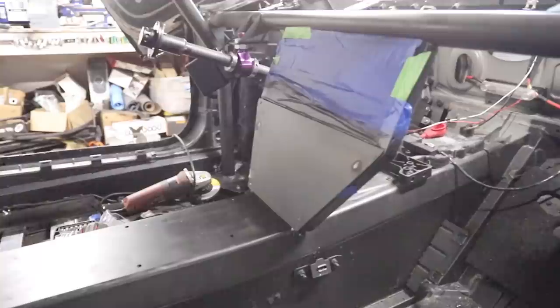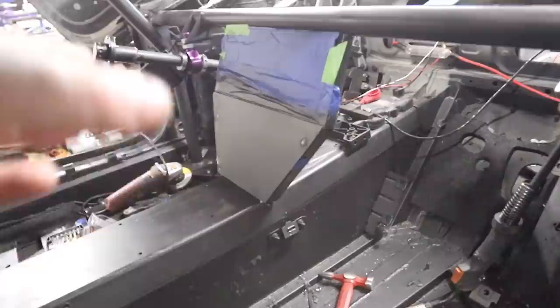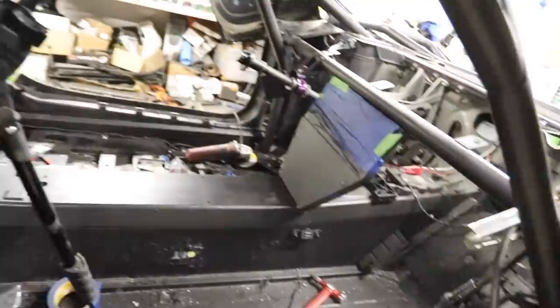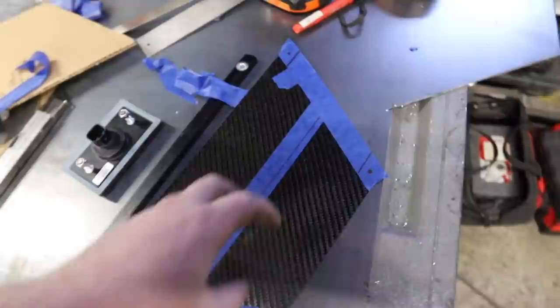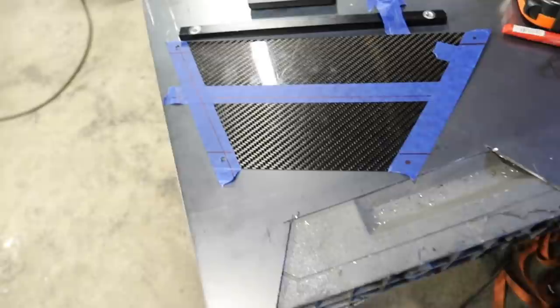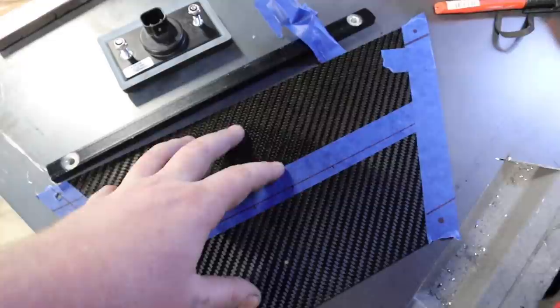I'll show you the work that Oscar's doing on the control arms when he wraps that up tomorrow. Let's talk about this dash. We got the screen mounted and a metal skeleton, but my skeleton didn't go down far enough to have a nice clean connection with the tunnel, so I was back to the drawing board. I put steel over it, thought it would be great and welded it in, but then I hit it too hard with a flap disc and it left some indentations I didn't like. So I decided we should have a facade — that way you can poke holes in the steel, do different things you need, and if you want to change your configuration you just change out the facade. I got a little piece of carbon fiber specked out, put my holes in it, but the holes were just on the edge of my skeleton. Drilling through one hole into a wall sideways doesn't work — it ended up breaking some welds.